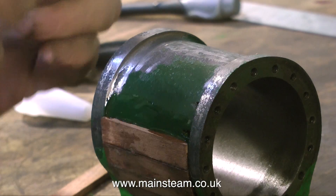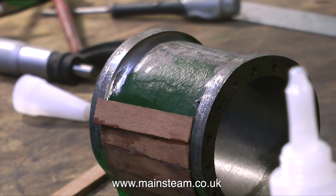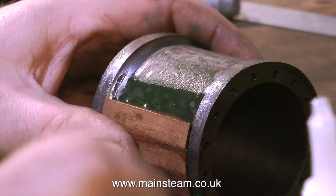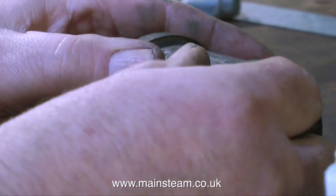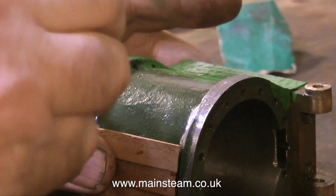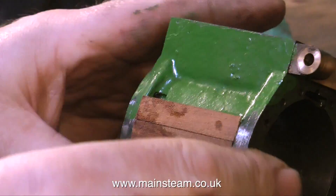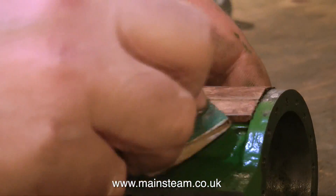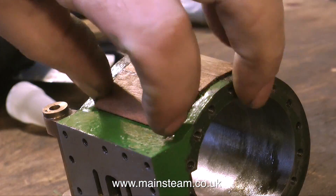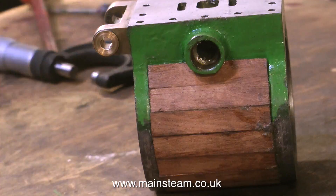I'm sticking them all in place with a copious amount of cyanoacrylate adhesive — CA glue or super glue, whatever you like to call it. The CA adhesive does not permanently stick the cladding to the cylinder, because as soon as the cylinder gets hot when you run it in steam, the part of the cladding in contact with the metal tends to separate slightly. You can then remove the cladding in sections, and the cladding — complete with paint — takes on the perfect shape of the cylinder and can be replaced quite easily. Sanding the cylinder periodically with coarse sandpaper fills up any gaps.